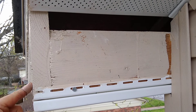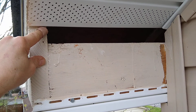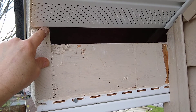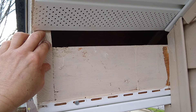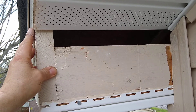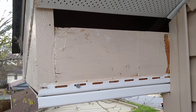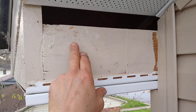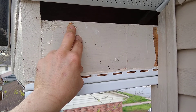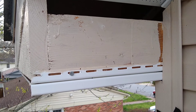Store-bought siding only comes eight inches wide, otherwise it has to be custom bent. The material — plastic vinyl or aluminum — otherwise you have to have it custom wrapped from a wide 12-inch piece, which increases your cost. If you're doing it yourself, make sure this board is no wider than six and a half inches, preferably five and a half, and you'll be good.